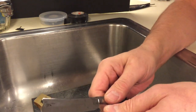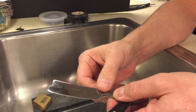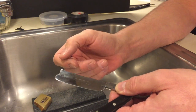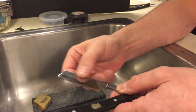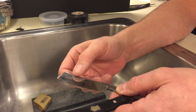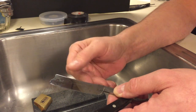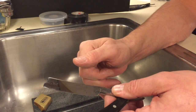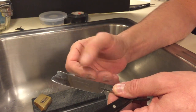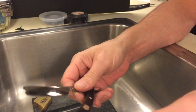Now, one way to get past all of that, if you needed to, you could just tape and then set the bevel and then pull the tape and then reset. Now, the bevel set stage is where you're going to probably see most of your wear on the lower grit stones. So if you get through that on tape and you pull it off, now you're 1 degree away from where it was with tape, and honing that back in doesn't take that long. It's like real fast, okay? So you're going to add a little spine wear, but not the same amount you would see if you had just honed straight without tape in the first place. Me personally, whatever.